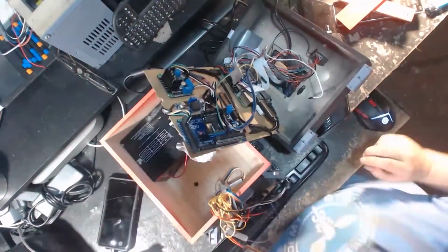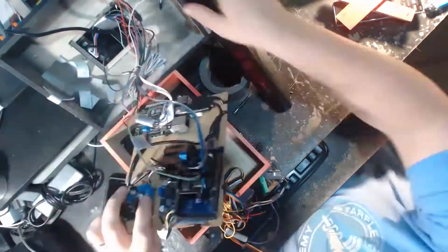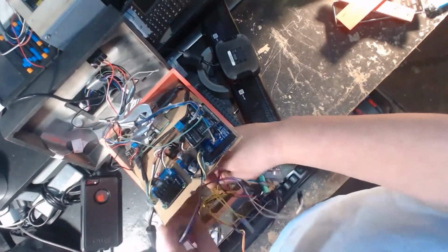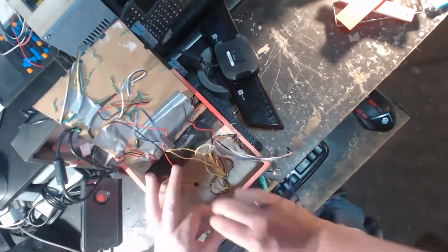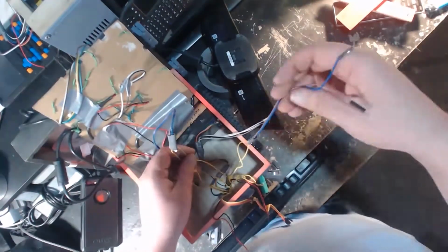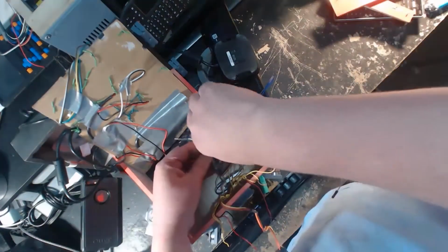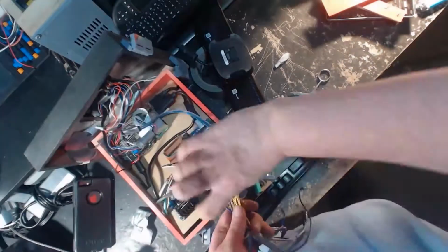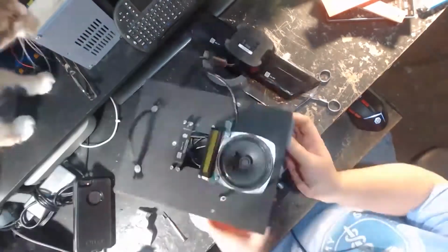I'm going to probably switch to a laser rangefinder on my larger robots. Here what you're seeing is I've put all of the electronic components for this robot on a piece of cardboard, and just kind of glued them down or tied them down, taped them down. I like to put all the components I'm going to use together, power them, make sure everything works, make sure it fits in the form factor I need, make sure that I can wire everything and I don't have something like a lack of amperage that's not going to let a board run. So I test all of that before I actually make decisions about the body of the robot.